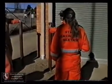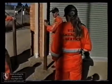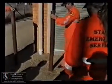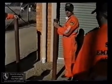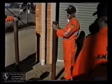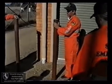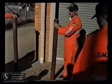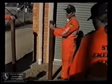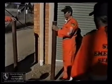One of the things for anchor points is a shake test. The thing's got to be able to not move. And if I shake that pole enough, it'll come out of the ground. So that fails the shake test. The other is a kick test. If you kick it really hard and your foot hurts afterwards and it hasn't moved, then it's possibly okay. I prefer the shake test. I do too. It's less painful.